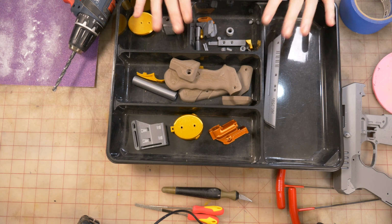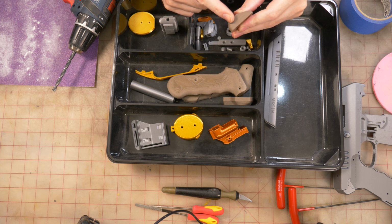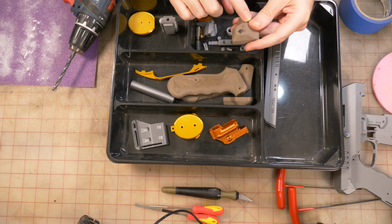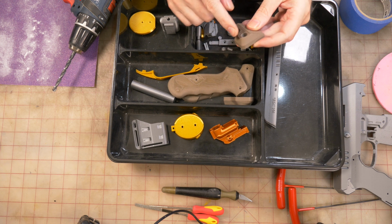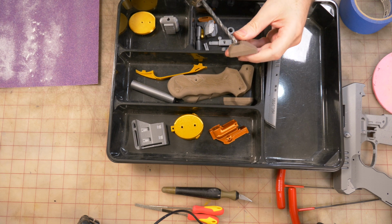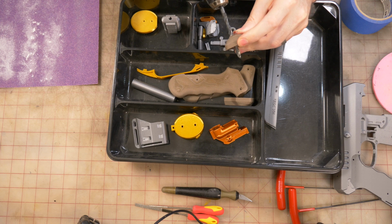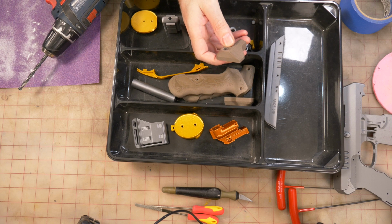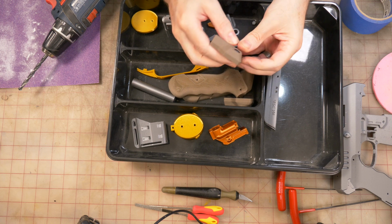The first thing we need to do is enlarge some of the holes. We're going to do all the through holes. These are holes where a screw will pass through them without getting screwed in. Now, due to shrinkage with whatever printer or plastic you're using, or an elephant's foot, or perhaps there's some support material down in there, you may have to take a slightly oversized drill bit and very carefully drill that out so that your screw will fit through it. It'll fit through it right there without resistance. So that's what we want.